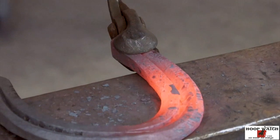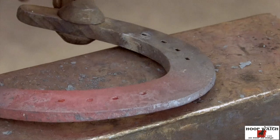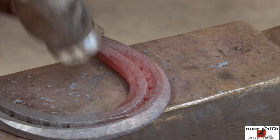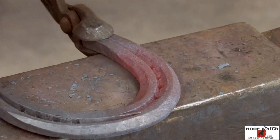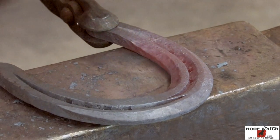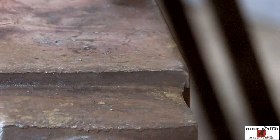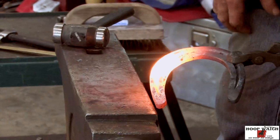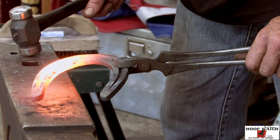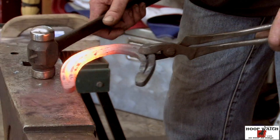Again, this is a good way to knock your teeth out. I can't get to it anymore because I've totally flattened it out. So one more time. And just, the more hammer blows, the more you're gonna have to get rid of the scallops. I think one of the problems you can see is that you're growing the whole time. You're forging on this, so you'd be better off not overdrawing it in the flat, and then you're stuck. You can't forge on it.